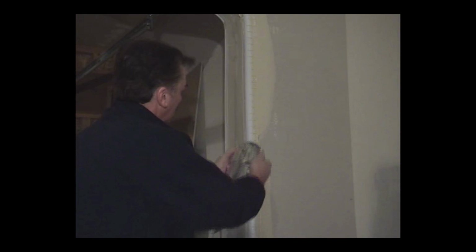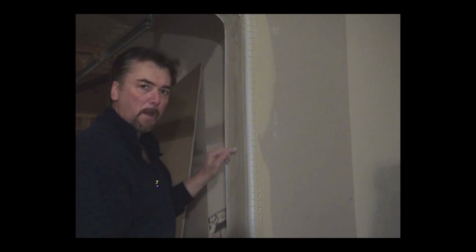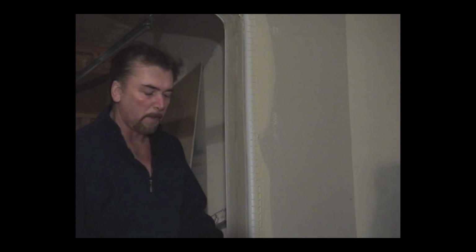So I would like to use a rubber drywall knife. So basically you just fold it very, very tightly and wipe your edge in between coats. The last thing you want to have is layer after layer of hot mud, dried hot mud, edges on your bead to try to clean off on your finished product. And now you're ready to use your fiberglass tape.